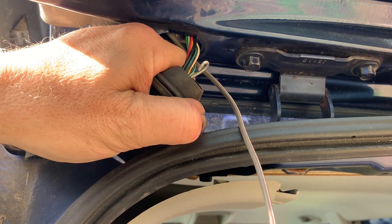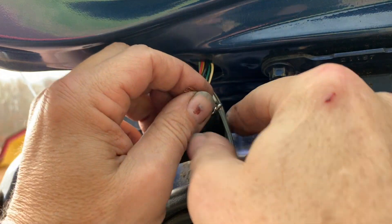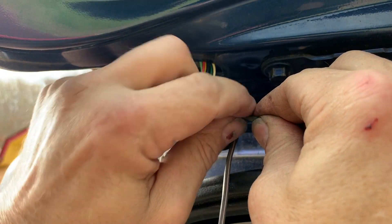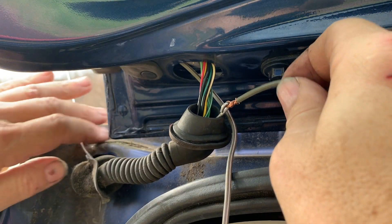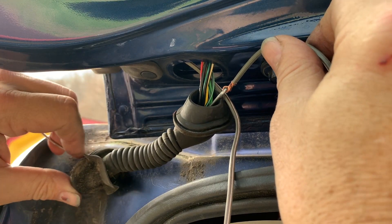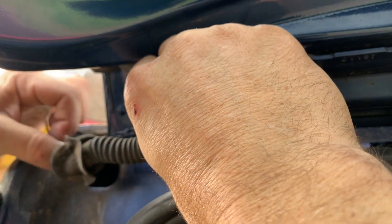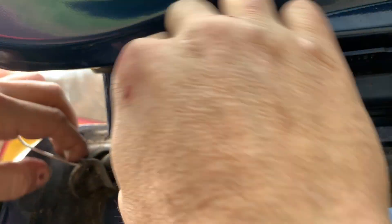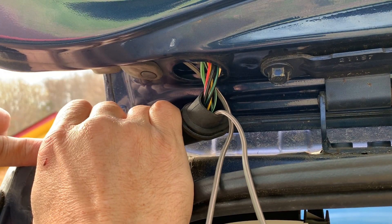Now we're going to do the same thing to this piece — this one is much tighter than the last one so the tie has to be pretty secure. I'll leave that little bit out, bend that around and just twist it around — like a sandwich tie. That's pretty secure. Now I'm going to very carefully work this back through there to not snag anything. If you're a real wire pull guy they actually make lube for this. We're just gonna have to persistently push this through — work it, work it, work it, a little bit at a time.